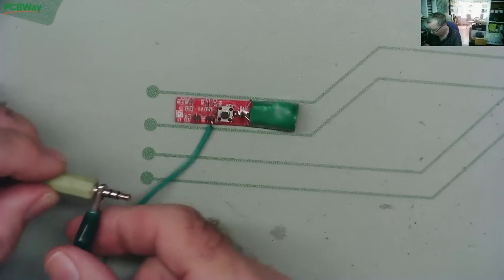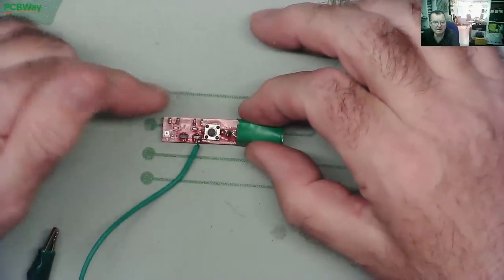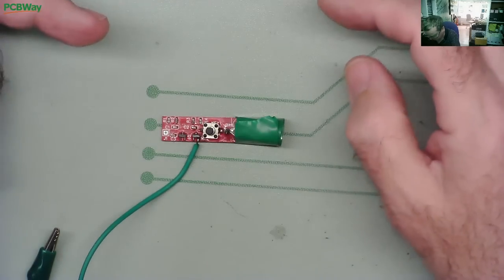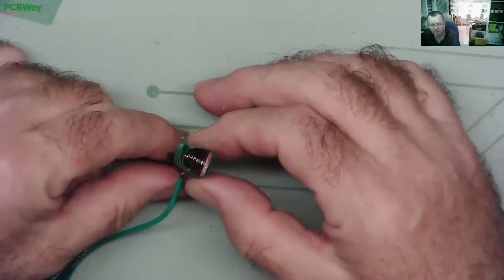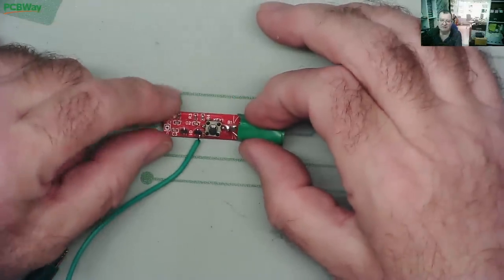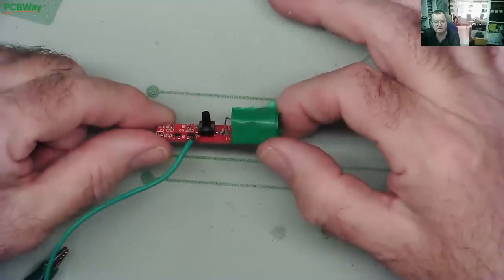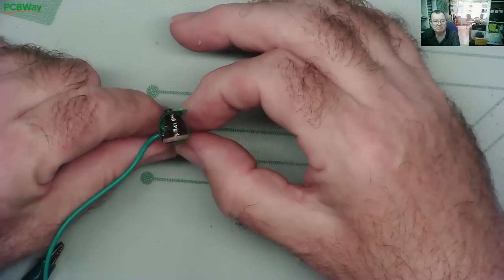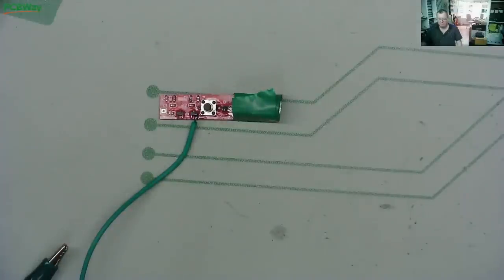Let's test this. This is my speaker - we'll connect the ground clip; I've actually soldered the ground to one of the emitters. I'll leave a pad on the board for the second version which is going to be smaller. We can connect the speakers to the output and try it. That gives a nice clean sound. The variable one made a sort of wobbling noise, so this definitely works better. The only problem now is the battery holder - for these very small button cells I can't seem to find proper holders, and the improvised one sticks up quite far.